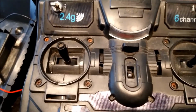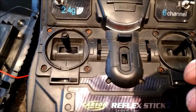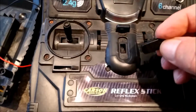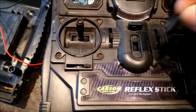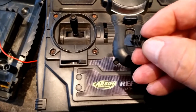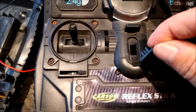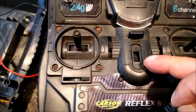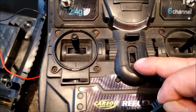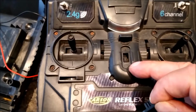and off again. And what I think had actually happened is that to allow the switch to be worked, they supply you with this piece of plastic which is built into the controller, and it sits there over the switch, and that fits into this moulding that you can see on the back here. And I think that this had worn, or for some reason wasn't moving the switch fully, and that's why when I tried to turn the controller on, and I believed I had turned it on, the switch hadn't actually moved properly to the upward position. And that's all I think the fault was.